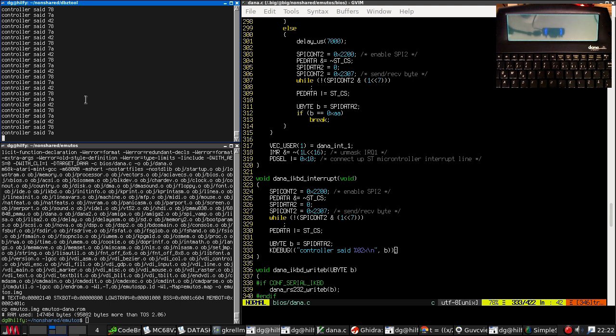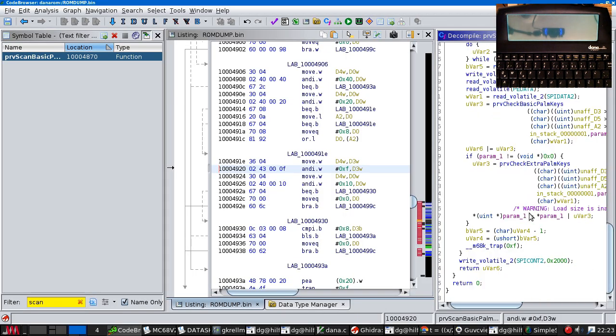What happens if I press more than one key at a time? Well, that's kind of slowed things down a bit. Okay, well, just hold down, let's say H, and then click Control C, and we've got, well, random bytes. However, we are getting a steady stream of bytes, which means that the microcontroller always has the interrupt line set. So do we have to tell it that we've finished?